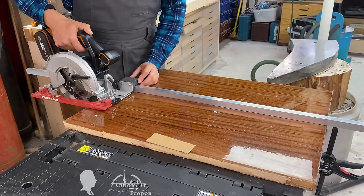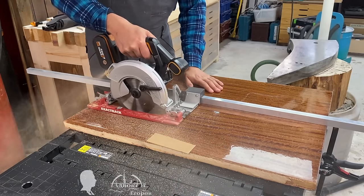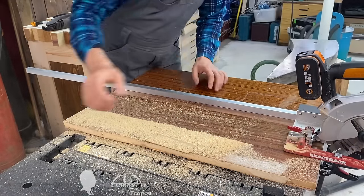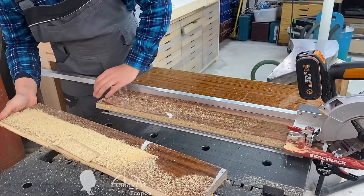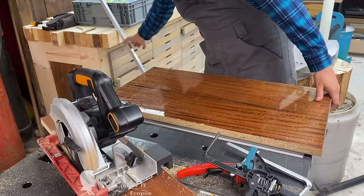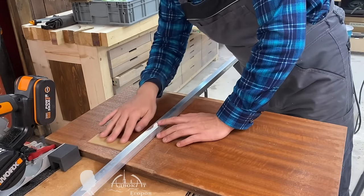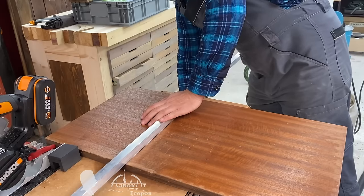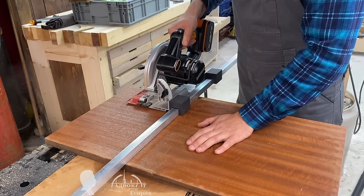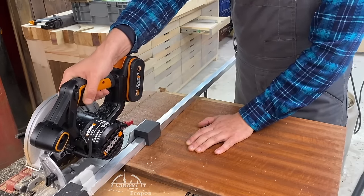First of all, I will make the simplest guide rail for a regular circular saw — the cheapest and easiest guide to make. Unlike a purchased guide rail, it won't take away a single millimeter of cutting depth, because it will rest its shoe directly on top of the material being cut, not on the rail, which steals about 4 millimeters of cutting depth. This is a regular square aluminum profile with a side length of 20 millimeters (0.8 inches), bought for less than $2 per meter. As a result, I got the cheapest aluminum profile with a T-slot usable for both standard T-slot clamps and regular clamps. The fashionable Festool FS 1400 5-foot rail costs more than $100, and my rail costs less than $2.